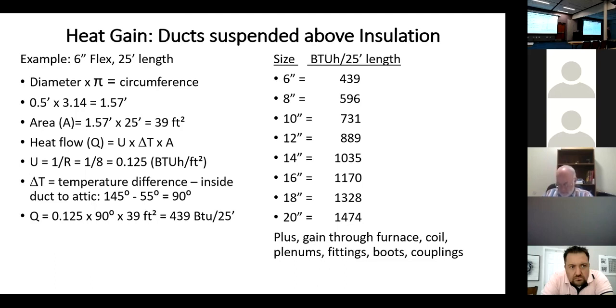They're always kinking it, bending around trusses — and guess what, they do it because we let them. Building inspectors walk into a job and there are instruction bags that the flex duct came in — every one of them has installation instructions printed on them. They say: no kinking, no squashing. The radius of the turn needs to equal the radius of the duct. For a 12-inch duct, at least a six-inch radius on the inside of the bend — and it has to be fully expanded.